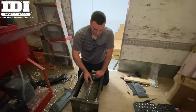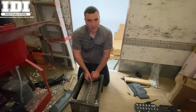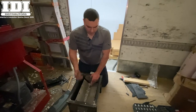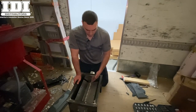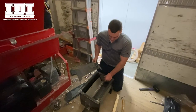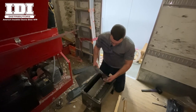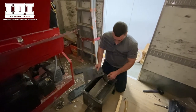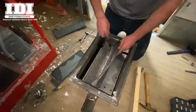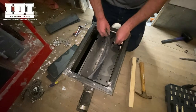One thing to check when replacing your seals is these steel plates. If they're bent at all, try to straighten them out — usually you can do that with a crescent wrench or channel locks, or put it in a vice. These all look pretty straight. If they're bent and we don't fix them, the seal won't sit properly and we won't get the right pressure. Now we take our new seal — I always take out all the old seals first to make rotation easier. As we put the new seal in, these little tabs on the side need to be tucked in behind the adjacent plate so they don't roll up.